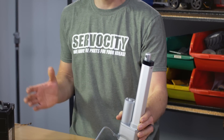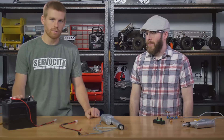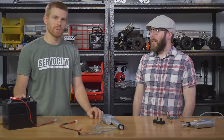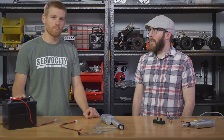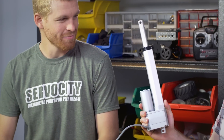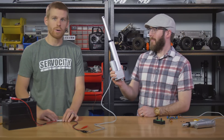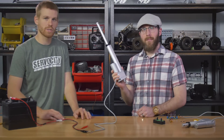For starters, I brought in a linear actuator. We're just going to supply power from a 12 volt battery to this and watch it run. You'll notice I've got a huge lawnmower battery here — you don't have to use one of those. You can use a small lipo pack or a power supply, or about anything that's going to supply 12 volts to it. Basically I'm just going to connect power to the motor. It's going to run out until it hits the limit switch and then it's going to kill power. Once it hits the limit switch, it's not pulling any current, so it can sit there for a long time — it's not going to drain your battery.